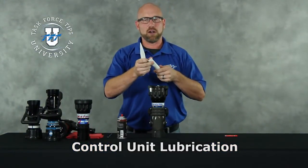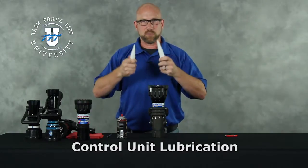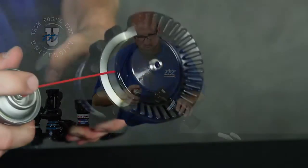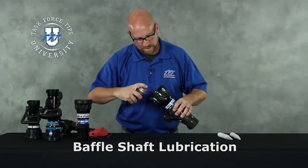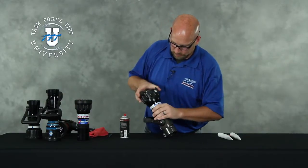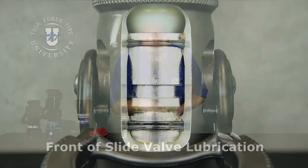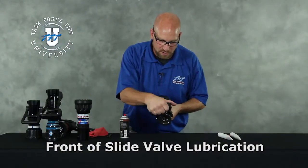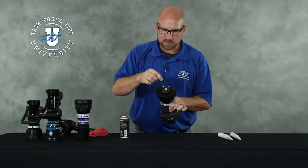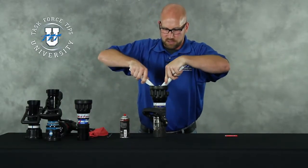A point on these: they are plastic and non-marring. You don't want to use something like a straight-edge screwdriver or something that can damage the back side of the baffle or the barrel cone. A piece of plastic or a good piece of hardwood generally works well. While you still have a large gap in the front of the nozzle, go ahead and give a generous spray down along the center baffle shaft as well as around the outside diameter of the nozzle in that opening. The lubrication will start to work its way down to the quad ring that seals the front of the slide valve. Move that back and forth a little bit to help work some of that lubrication in. Spraying against the shaft gets lubrication against the center shaft that holds the baffle into the control unit of the nozzle. Work the baffle up and down a few times to help that lubrication work into place.